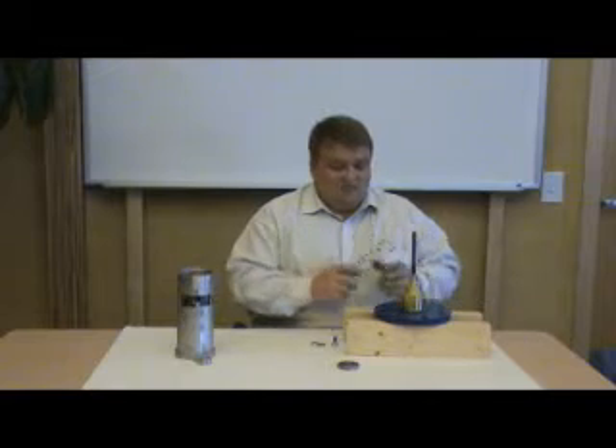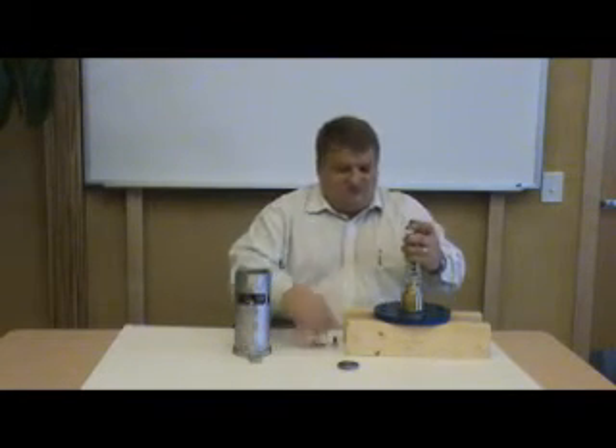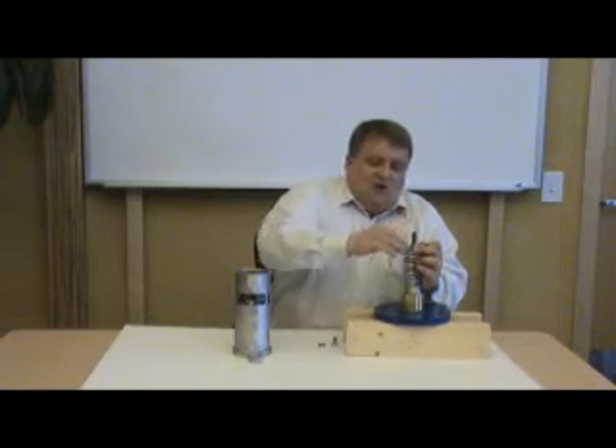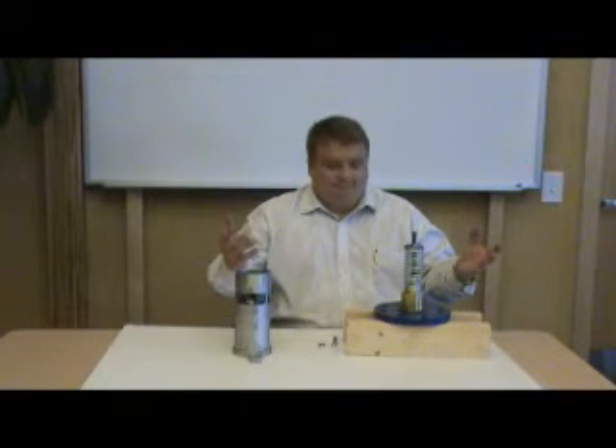Which leads me to the second part of this valve that is really neat, because weight-loaded valves come in pre-set type weight classes that correspond with a set relief pressure. Here, your set relief pressure is marked on this little data tag, and the valve set pressure is set by means of the valve spring and the adjustment rod. Along the valve rod length, you can virtually adjust it to any desired pressure. We are not limited to a certain weight class or weight size, and by means of the shock dampener, we guarantee a smooth action of your pressure throughout the operation of your system.